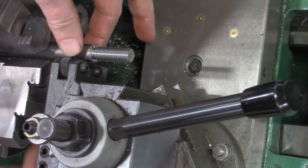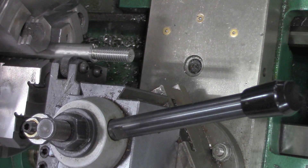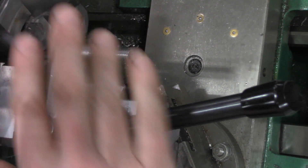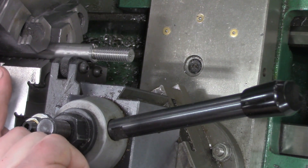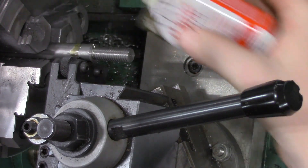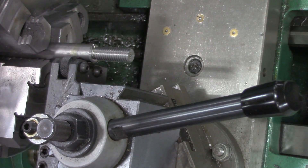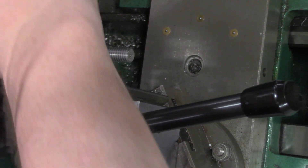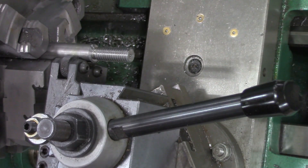Now both the top and bottom wheels are engaged and I like it. This is going to put a lot of pressure — it's not a cutting action, it's actually forming bumps and ridges. So it's going to put a lot of force against the part. We want to make sure we're chucked up pretty close to wherever we're doing the knurling to get the best results. This is done at a relatively low speed, so I'm going to set the lathe up for 70 RPMs.